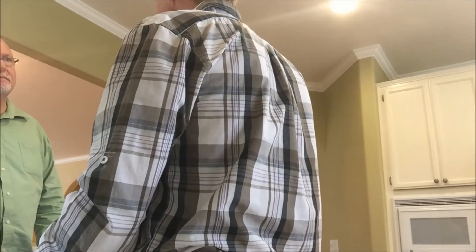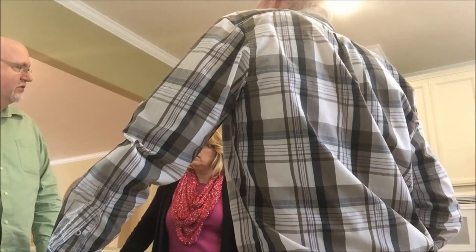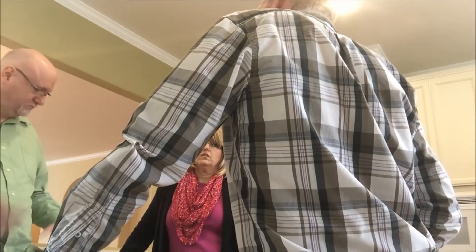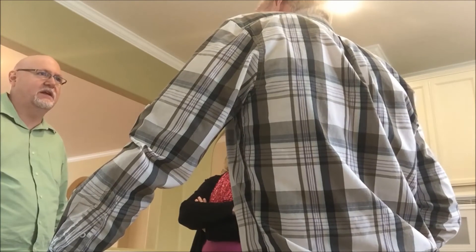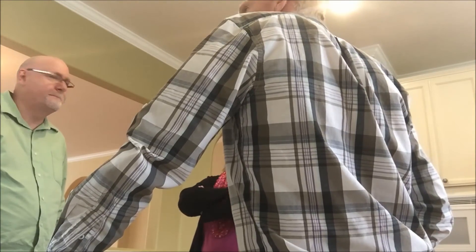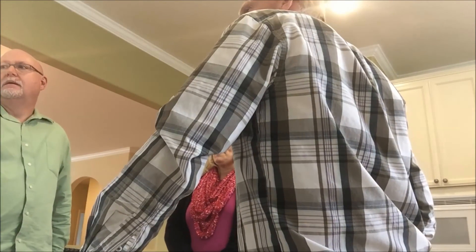The main concerns are getting a heat and air guy out to check that pan, and a roofer or gutter company to check that back corner where water is leaking past the drip edge onto the wood — that wood is getting wet all the time and will rot in the next couple of years. As for adding more insulation in the attic — it's about $800 to $1,000 to add another four or five inches, but you'd have to be here 20 to 25 years just to get your $800 back. The fence on the west side has posts with over a foot of movement back and forth — leaning four to six inches toward the neighbor's yard. It's a 12-year-old fence.